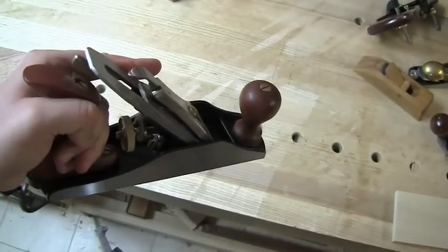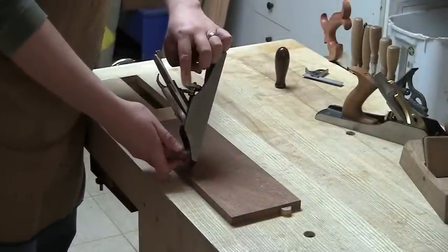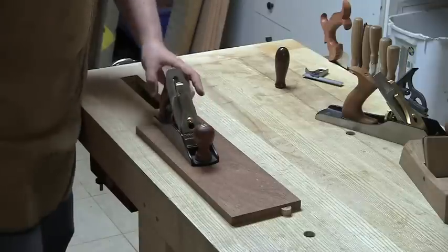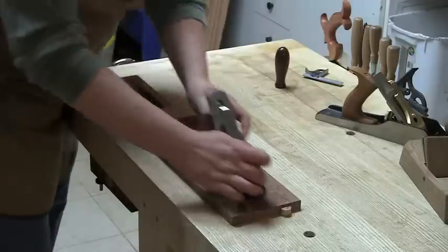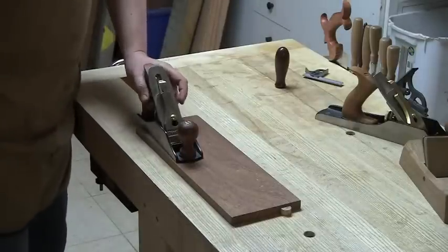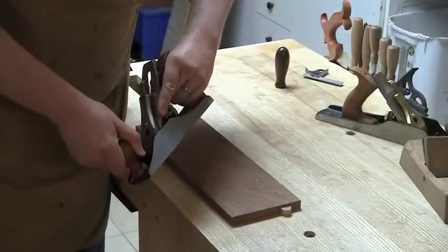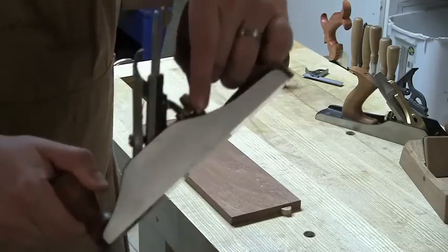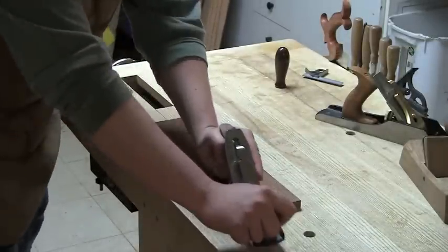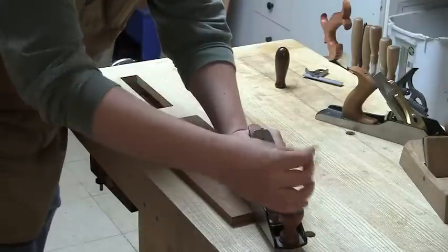Now this plane should be ready to make a cut. Before I start cutting, I'm going to move the adjustment wheel counterclockwise just a little bit to pull the blade back — I'm making a smoothing action, so I want a really light cut. In planing, you always use a three-finger grip and point your index finger along the frog. Your index finger can also come down on the adjuster knob to make adjustments on the fly. I'll turn maybe a quarter turn — no shaving yet — so I go another quarter turn, and now I've got a little bit of a shaving coming out.